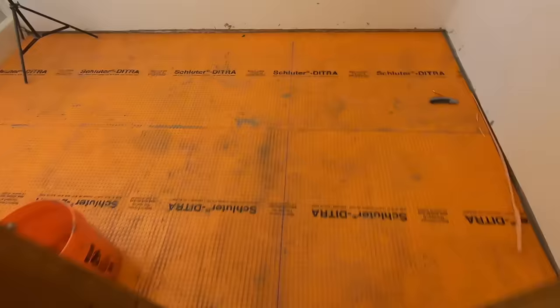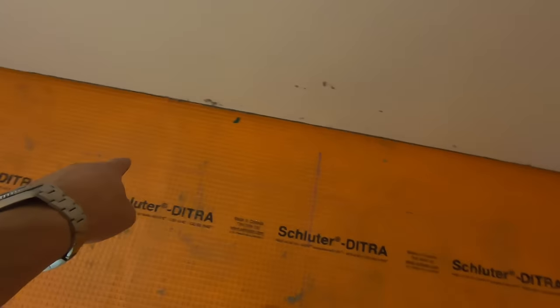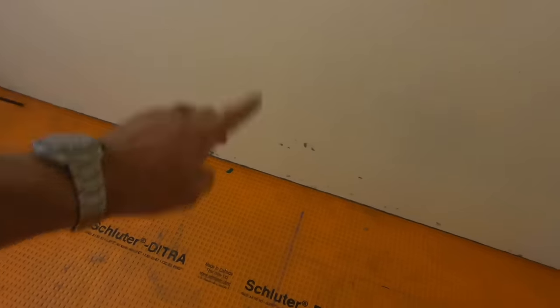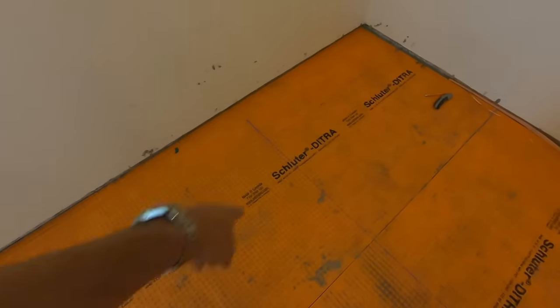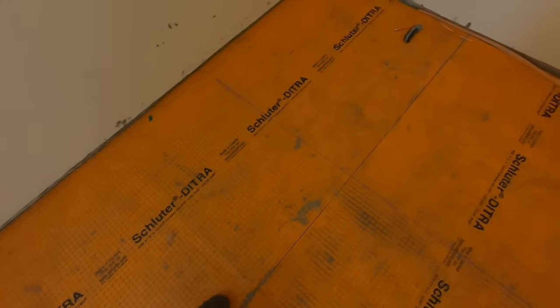Pretty, pretty close. So this chalk line goes all the way down there — that's parallel to this wall. What I want to see is whether this wall here is perpendicular to that wall out there. I'll do the same 3-4-5 triangle with these two lines; I can do it on both sides. We'll see where we are once I get that part done.